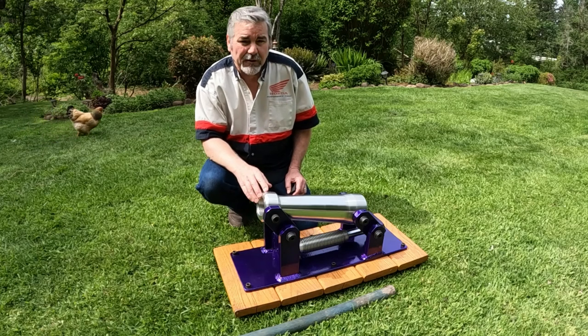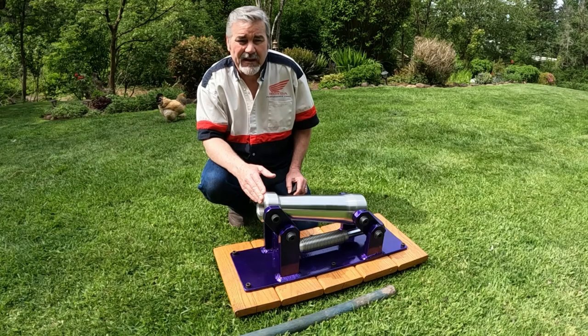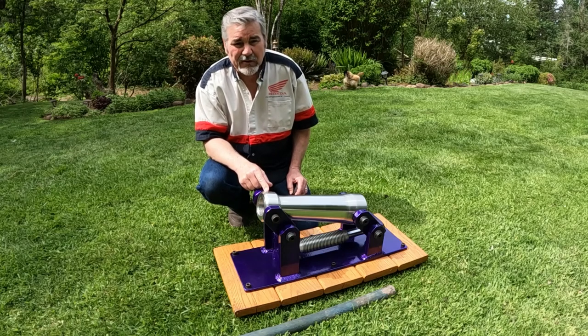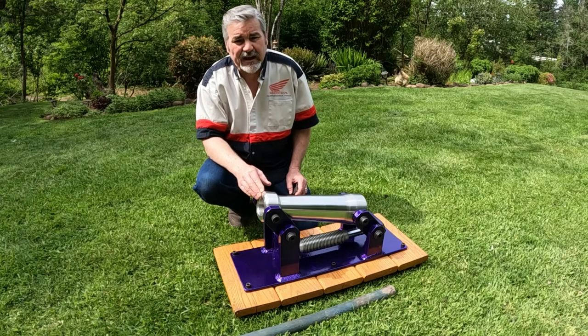This particular stainless steel — I found it at a scrap yard. It was just a solid piece of stainless. I didn't know what alloy it was; it wasn't marked. Sometimes you get the wrong alloy of stainless and you can't even hardly machine it — it's real miserable. This particular metal turned out to be machinable, and it gave me all kinds of challenges.